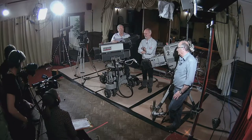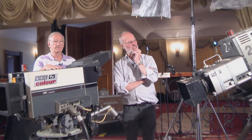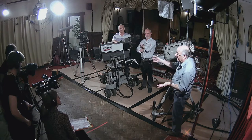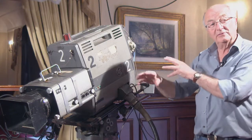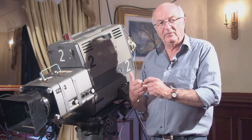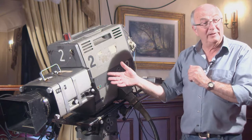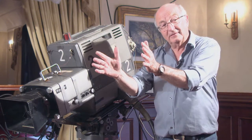These cameras were much less sensitive - they were probably less sensitive than the last black and white ones. Because you've got filters in the light, you're splitting light into three or four directions - the same light's going in but you're using quarters of it to feed four different tubes. This one's a bit better because we've only got three tubes, so slightly more sensitive. Outdoors was better - God's light, you did the best you could. Floodlit things were not too good, even with a lot of light, and zoom lenses would tend to get darker and darker the further down the glass you got.